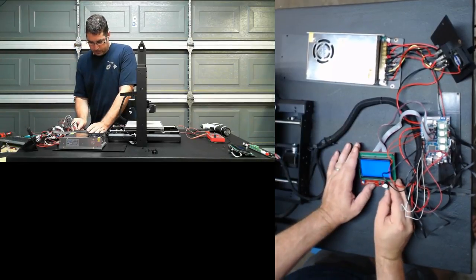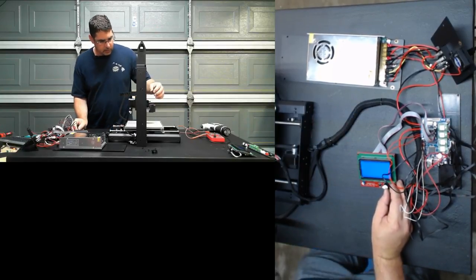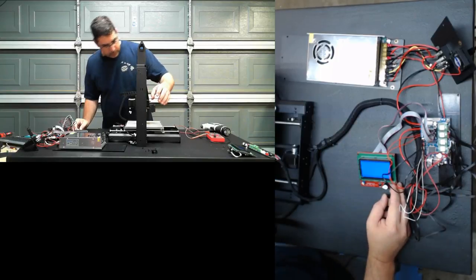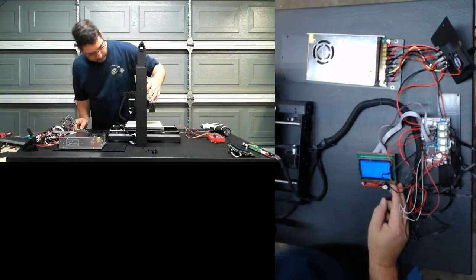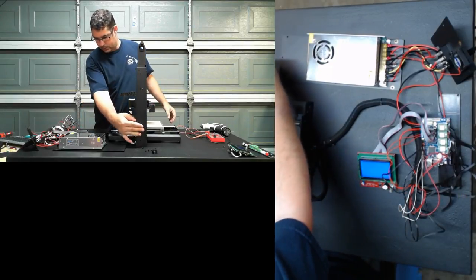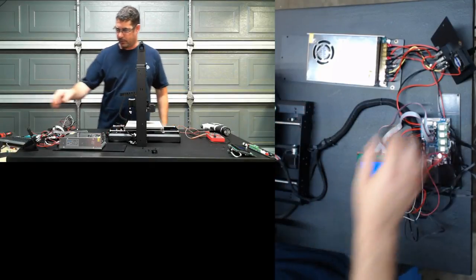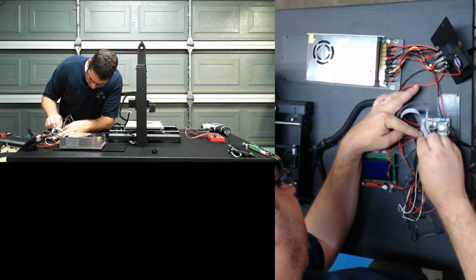All right, let's go back and play with our jogs. So let's try our X first. It's going the right way. Where is my X? And stop is where? There it is. Okay, so when I hit the end stop, any of my end stops, that's our problem. So let's power that down. Let's move all of our end stops over by one.